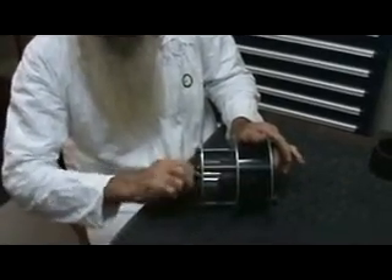Just one time out of the box — loose, tighten it up, final check, listen, feel. Very nice adjustment, very nice alignment, very simple adjustment. I'm able to repeat this time and time again. I'm very satisfied with technical bulletin number five as the simple way of getting an extremely good burr alignment on the Pharos.